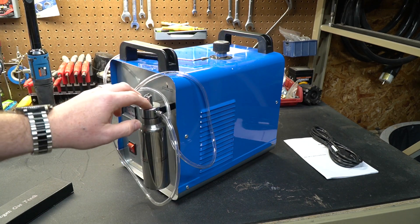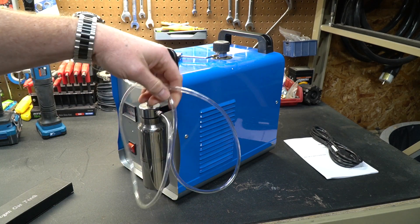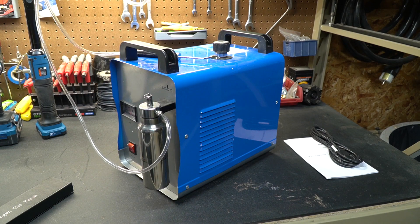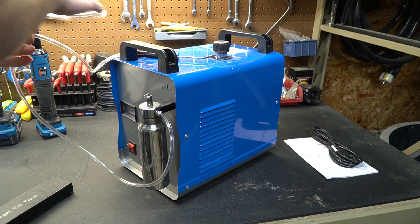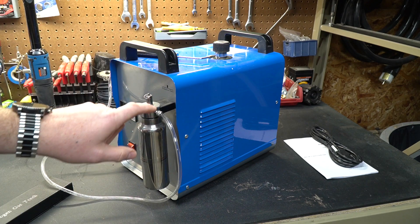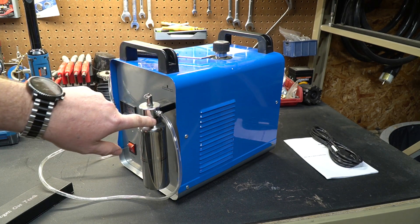The whole point of this bubbler is to add a little bit of protection. If you were to have a flashback — meaning the pressure is less than the speed at which the flame can travel back through the mix — instead of going directly into the hydrogen container, it'll get check-valved at this bubbler.